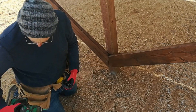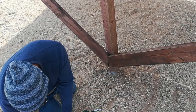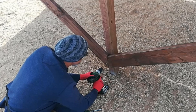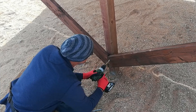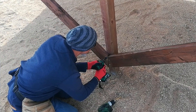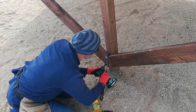When installing the lag screws - I believe they're 5/16 inch, about three inches long - I'm going to pre-drill, especially at the center post where two 2x6s meet in the center of a four by four. Then using an impact driver I'll drive the lag screws home. I used washers as well, but I had to fiddle with them because they were about one size too big - they served their purpose but I had to be more cautious getting them centered under the head of the lag screw.